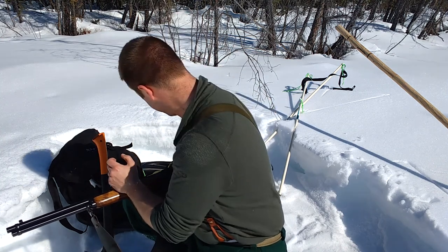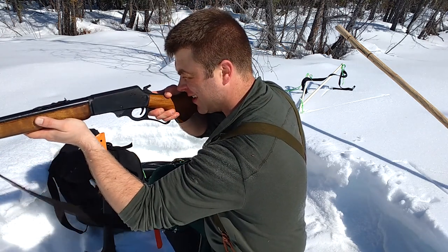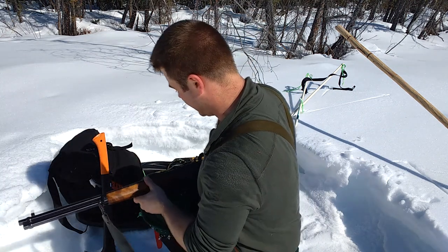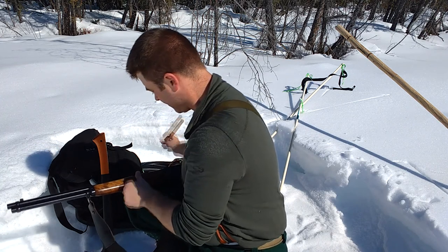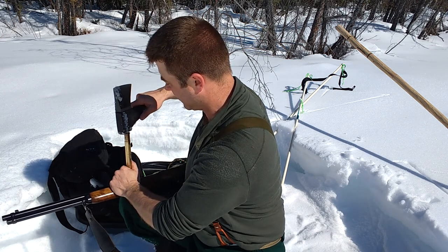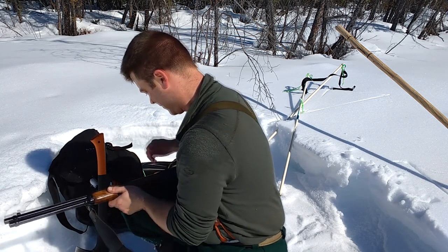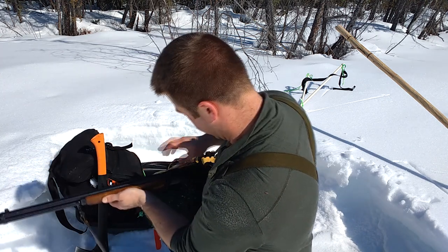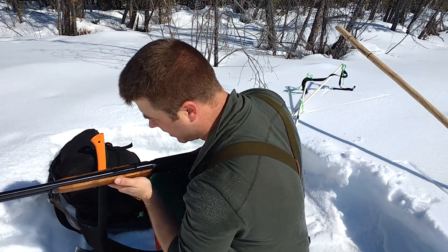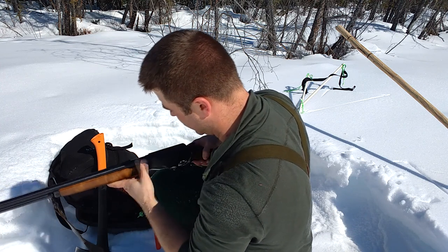You're going to want eye protection. Don't be stupid like some of us. And even just now, yeah, so that notch is almost in line with the screws on the receiver. We're going to put a scope on it. Just a wee bit more. And I'm glad I used Fluid Film on my gun. That's beading up just like water on a duck's back. There we go. And my dovetail, I've got just about the same gap on each side now.